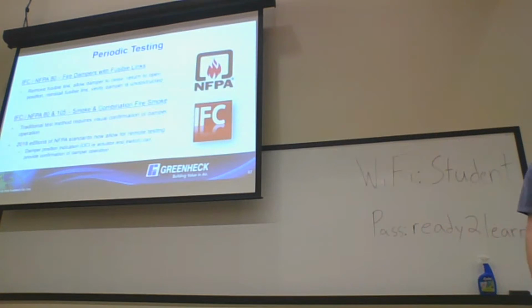That'll get picked up during acceptance testing. That's the first initial test in the building. If there's a screw in it, you'll pick that up then. It shouldn't happen during an operational test a year later unless somebody was messing around with it. Yeah, and that's what we see, nuisance tripping, right? For some reason, there's a system issue, so we'll just get this opening and running for now, and then nobody ever goes back to figure out and fix the issue. They put a Band-Aid on it and just run away.